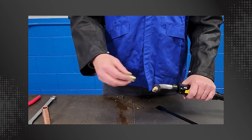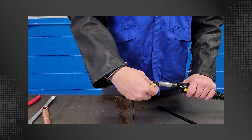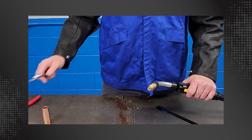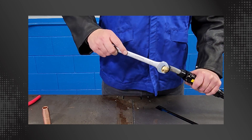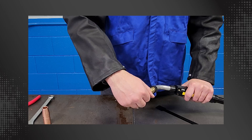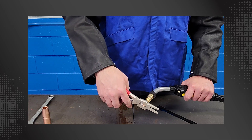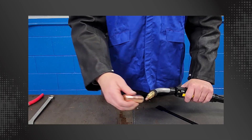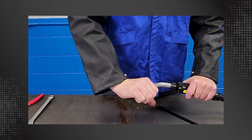To lock the center of the liner, install and tighten the AccuLock S dual-locked liner gas diffuser with an appropriate wrench. Install the AccuLock contact tip and tighten with welding pliers. Install the AccuLock S nozzle and ensure the neck insulator is installed properly.